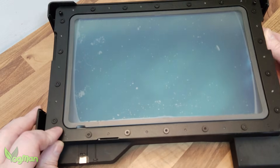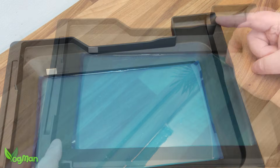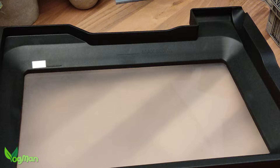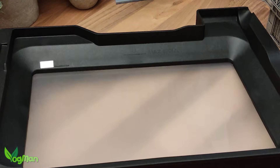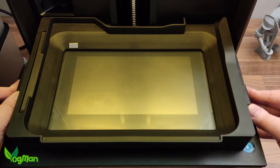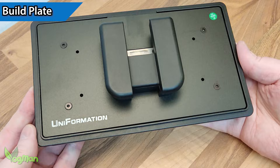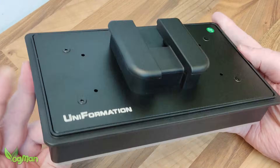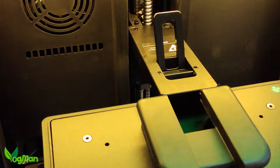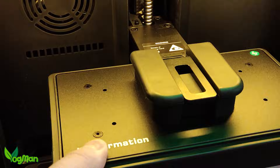Whilst plastic, the resin tray seems robust and includes an easy pour spout. The tray is fitted with a CPFA liner, which is actually a new one to me, but is probably some rebranded PFA liner. The tray locks into place using two adjacent tabs and the fitting feels very solid. The build plate is surprisingly thick and heavy with a sandblasted metal plate — it simply slides onto the Z-arm and is firmly held in place with a single lever for a perfect fit.